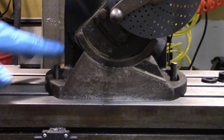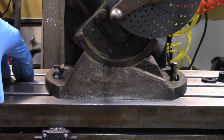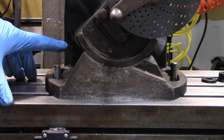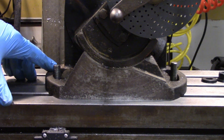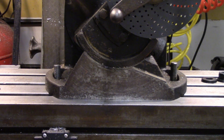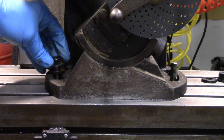Most of the time dividing heads really don't have a lot of clearance, so even the shortest set of studs in the clamp set is a little bit too tall — it sticks up another inch or 25 millimeters above this. So I'm using some all-thread just to try to keep it as low profile as possible, and then I like to have the hardened washer in there as well as the flange nut.